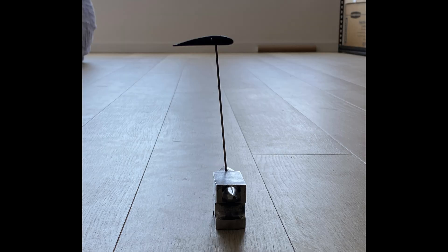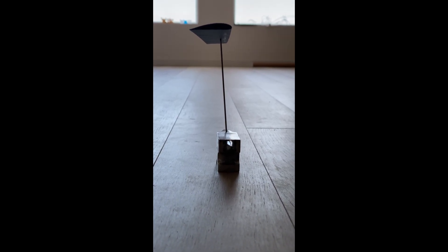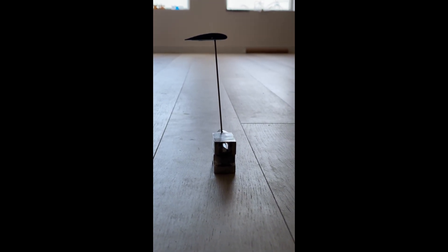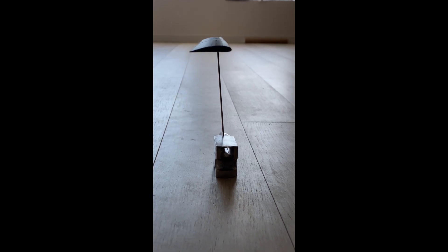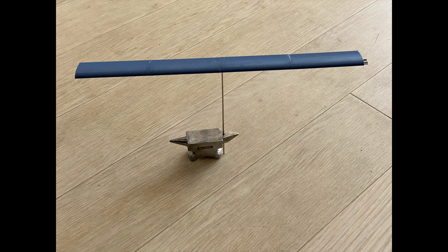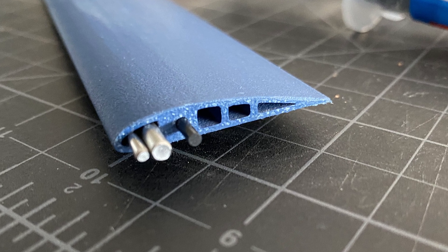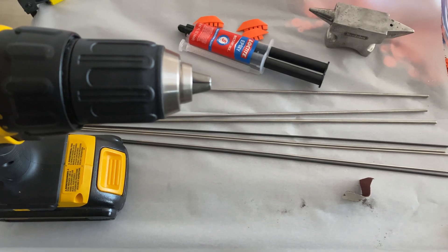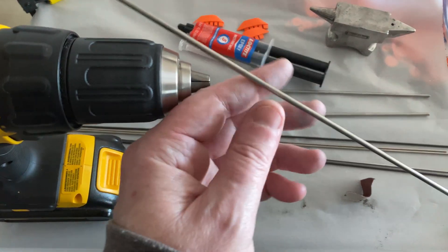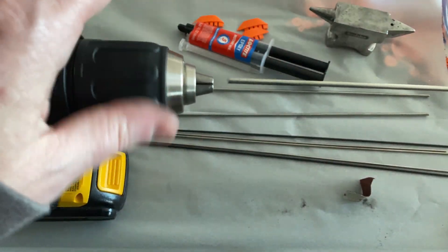Here, the blade is supported by a narrow rod. By positioning the blade carefully on the end of this rod, we can measure the center of mass. As expected, it's located at about 30% of the chord. Span-wise, the blade is nearly uniform. There are two steel bars located as close to the leading edge as geometry would allow — one is two millimeters, the other is three. These sit in the chamber forward of the quarter chord.